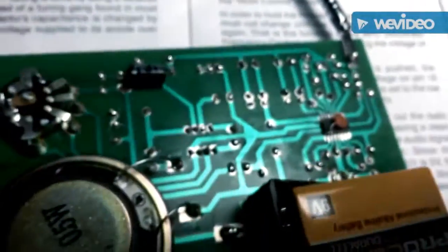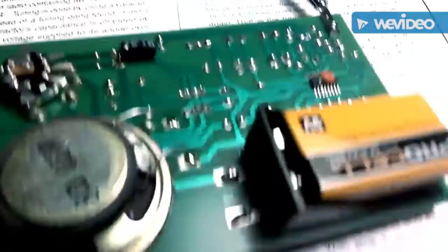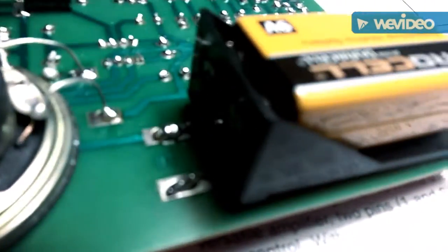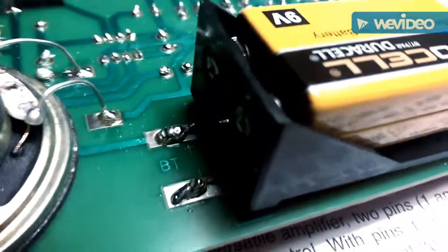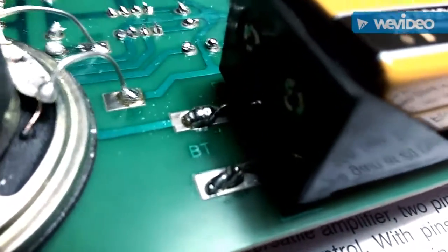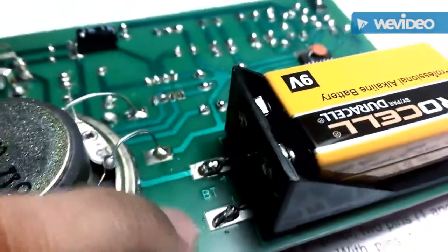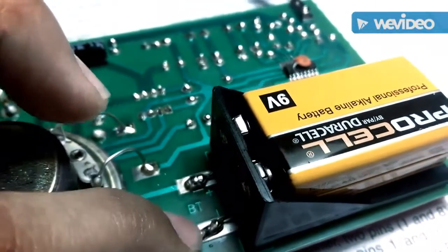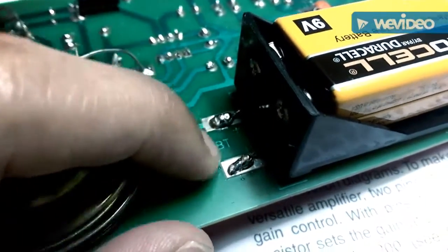The last thing you need to put on this is just the antenna and the battery. Also for this FM radio, there are going to be two metal rods. You have to bend them by force. It's not going to break, but for this one you're also going to have to put solder onto the metal plates first, and then you place some more solder onto the metal rods and the plate. You see here, hopefully.